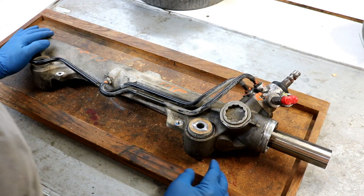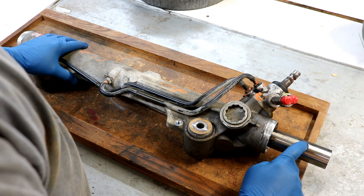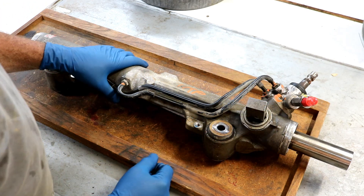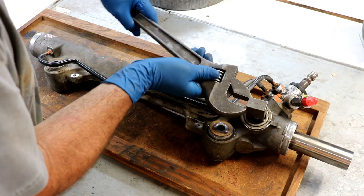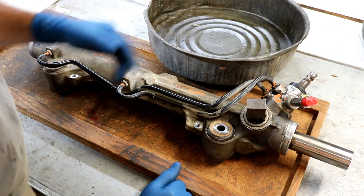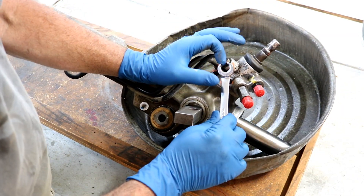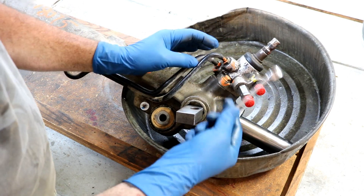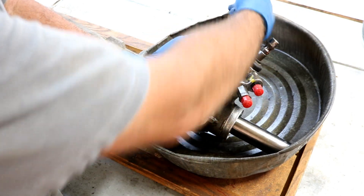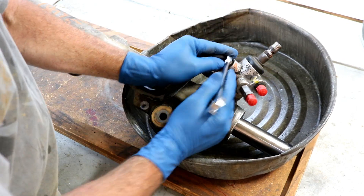On the far end, there's a snap ring and a nut that needs to come out. We're going to take this out so we can put it in the lathe. This was really tight but I was able to get it loose — made a little lock-up that fits right in there, and with a wrench it'll just turn that loose. First, I'm going to undo these hydraulic lines. We have a catch pan and we'll drain the oil out. I'm using a tubing wrench — it has a little slot and is basically a box wrench made for tubing fittings. It slips over the tubing and gets into the nut. I've already loosened these a bit, but these wrenches won't screw up your nut.